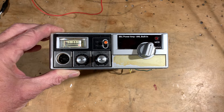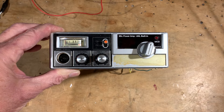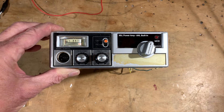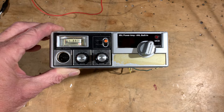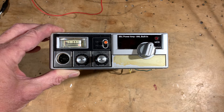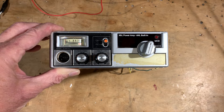He was running an SSB rig. But I remembered after talking to him that I had a CB rig that I picked up probably for parts at a ham fest many years ago. It's been sitting in my junk box all this time — this old General Electric rig. I pulled it out and started looking at it. The first thing I discovered was that it's an AM rig, not an SSB rig, so it's much simpler. I started thinking that maybe I could convert it to transmit on the de facto AM frequency on 10 meters, because I've been hearing dedicated AMers talking about contacts on 10 meter AM. The 10 meter AM activity goes from about 29 megahertz, which is the calling frequency, up to about 29.1.